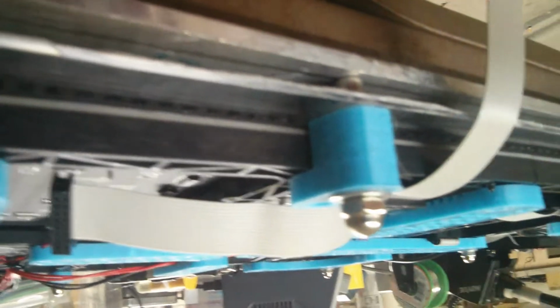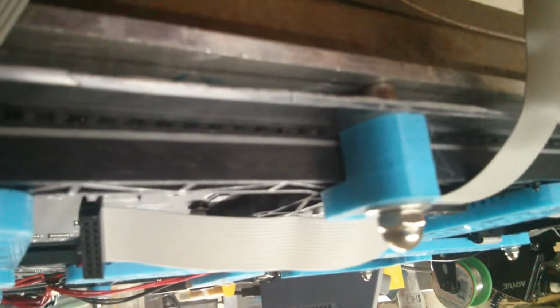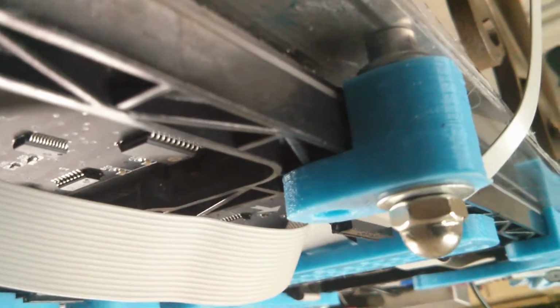You can see that the way to do this in Blender, if you don't have a micrometer and you're doing this sort of work, spend the $10 and get one, because it'll save you enormous amounts of pain. Use the micrometer, measure out the panel, figure out what its height is. And again, my printer has a tolerance of 0.4 millimeter on the print. But you can see that it wasn't critical on these pieces, so I didn't model it too exactly because there's an air gap there. But you can see that on this piece it was pretty critical.